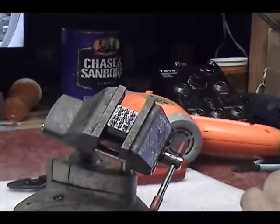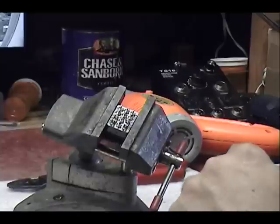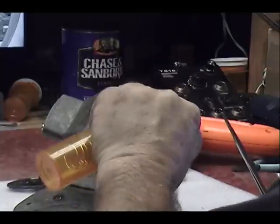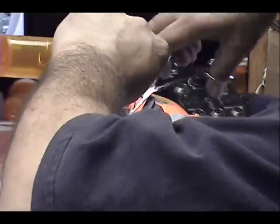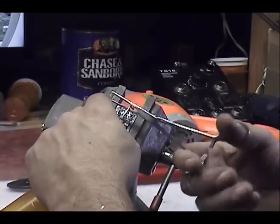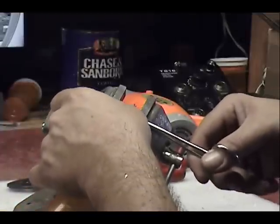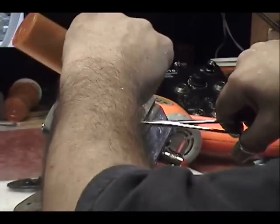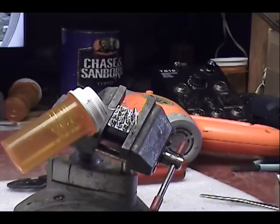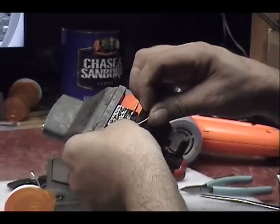All right, first thing I'm going to do, run my first jumpers here. You can just watch. That's pin 3. And now I'm going to come all the way down to pin 11. And then I'm going to come up from pin 11 and go all the way over to pin 1 again. And then down and out. So I kind of just rig that a little bit, see how long I want it, cut it. Thread it through there.